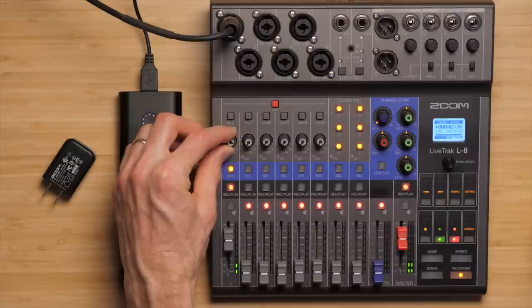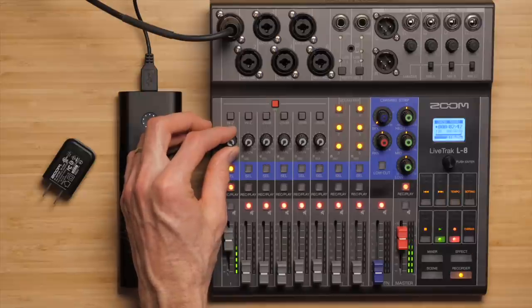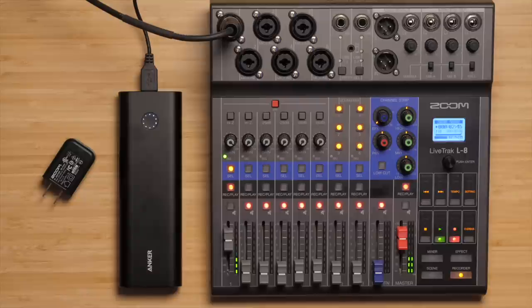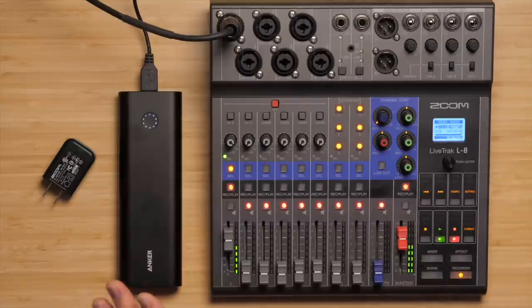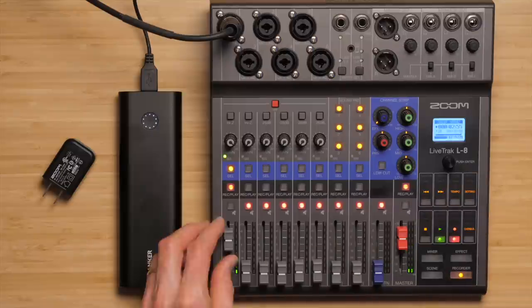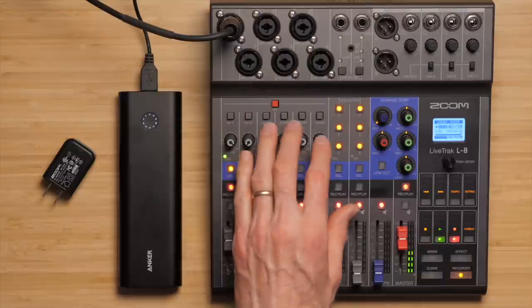You can see we can go up to 54 dB. I'll push it here to 54 — this is what it sounds like at 54. All of this audio was recorded with this, and then in post, what we did is we normalized it to minus 23 LUFS, just so you can hear what it sounds like out of the recorder. We didn't do any sort of other processing. In addition to a dedicated gain or amplification dial for each of the inputs,